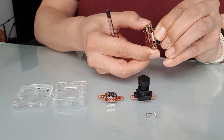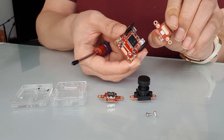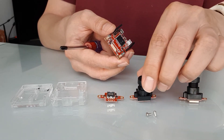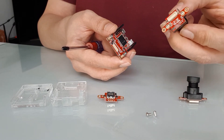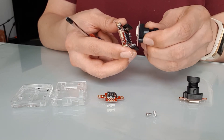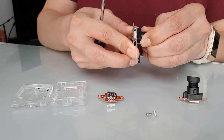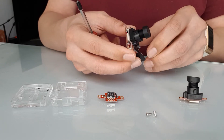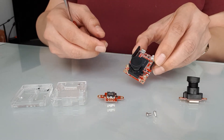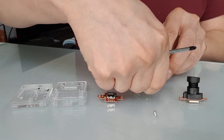Gently wiggle the camera sensor while pulling it off the main board, or put a screwdriver between the sensor board and the main board to pop it off. Do not attempt this while the board is powered. Next, take the other camera sensor and push it onto the connector of the main board — be gentle, you don't need a lot of pressure to pop it in. Now put the screws back in; to fasten the screws, turn them clockwise.